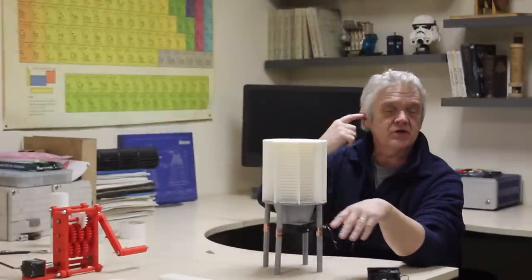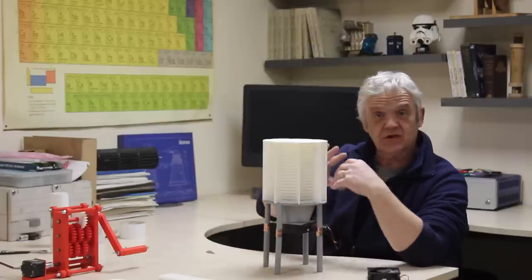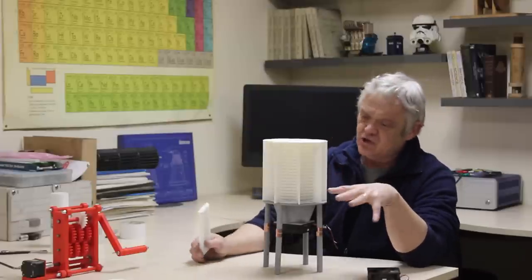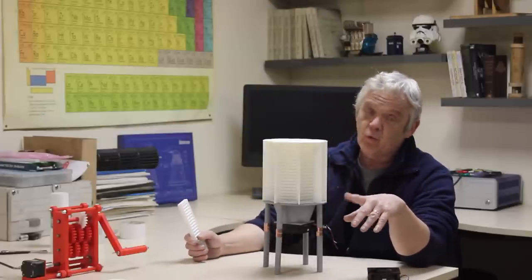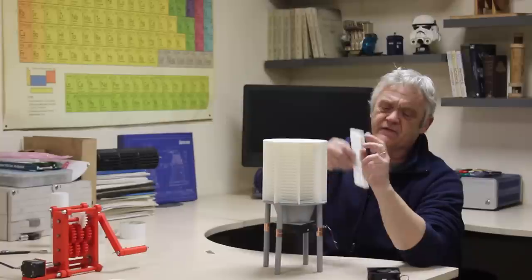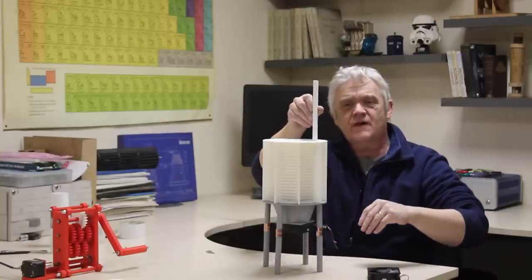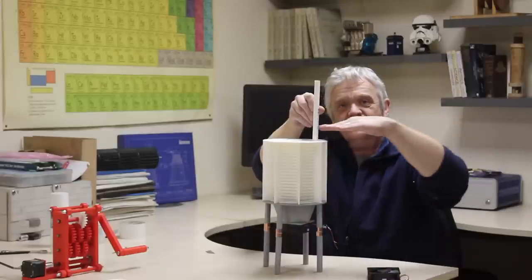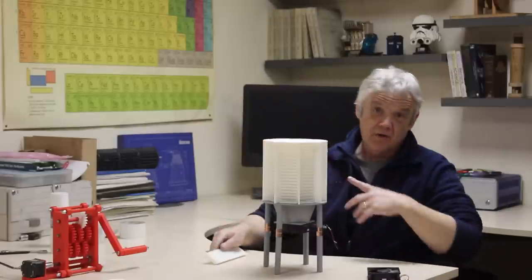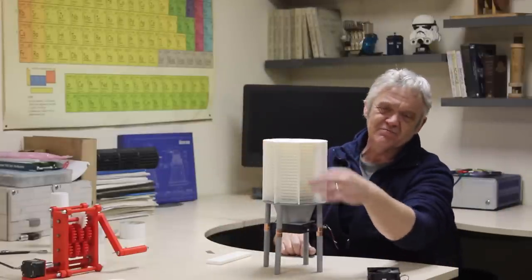This bit sticks up so you could put it on a roof or a tower or whatever you wanted — it sticks up where it's going to capture the wind from every single side. These fins here are angled at 35 degrees sloping downwards, and when I say 35 degrees I mean 35 degrees to the direction of the wind. There are eight of those and we can try to capture wind from all directions. I've put these extra bits of baffle fins on.